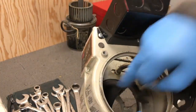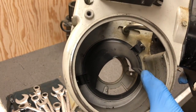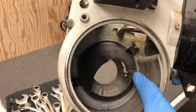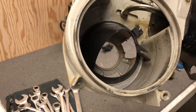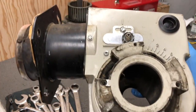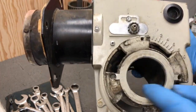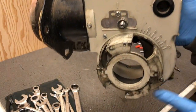This little plastic shroud right here is to guide the airflow — all Beckett AFG burners include this little air guide. Flip it around and you can see this is where the fuel pump mounts, the air shutter goes here, and then the air band goes right around here.